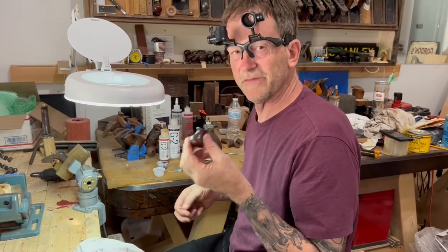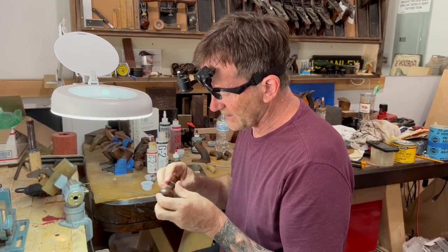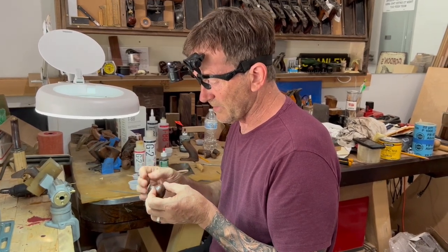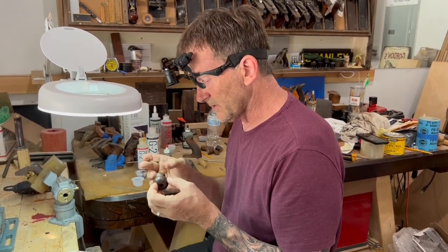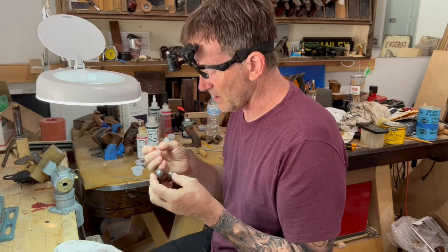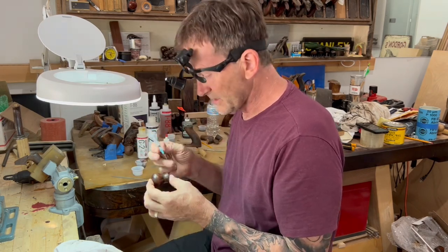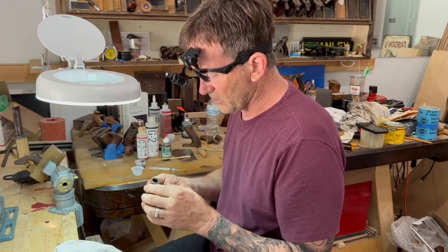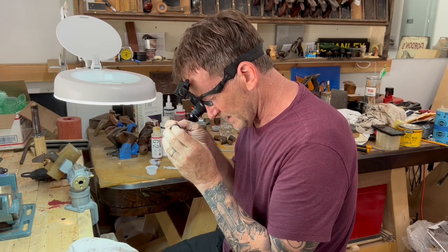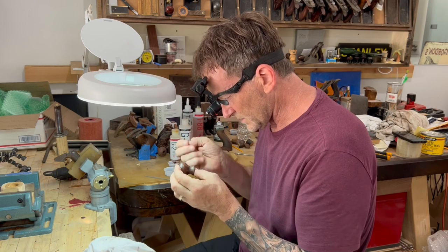At this point I'm using magnification and a series of jeweler's files. What I'm doing is just taking my epoxy line off and working it really fine. Rather than put this on the lathe and spin it and alter the patina and alter the shape, I really just need to get under the adhesive and level it back out, trying to make that joint go away. Under 10X or 15X, this file kind of looks like a snow shovel on a sidewalk — it's really easy to see and get detail. I'll use a syringe if I have to — I can tip in epoxy and fill in any little void if I have an air bubble I missed. I'll go back in and touch that up too. This is about 20 to 30 minutes of detail work.